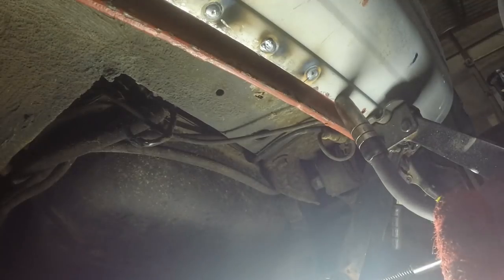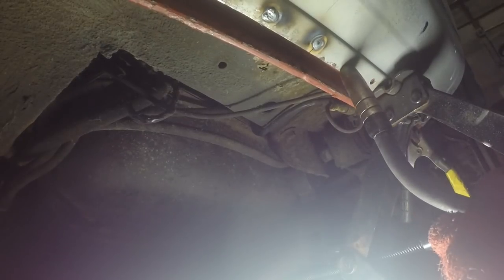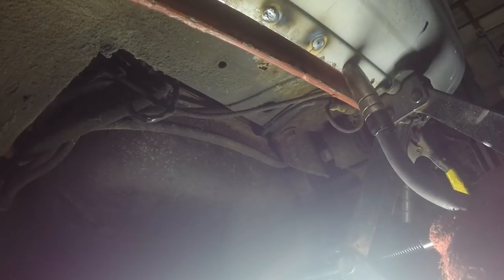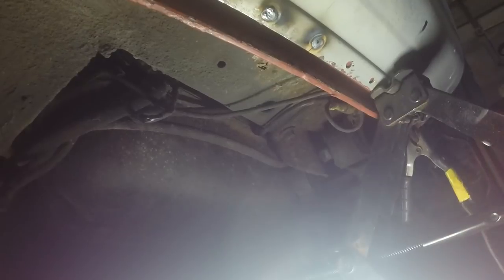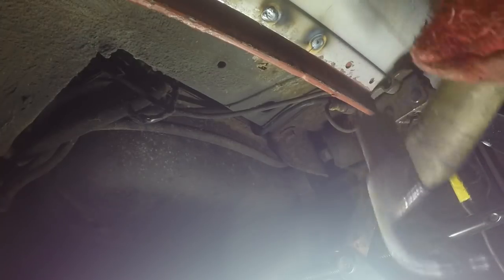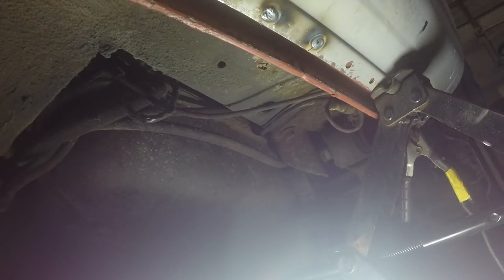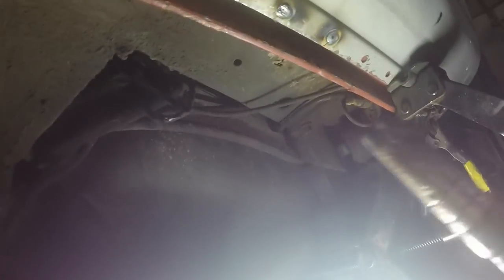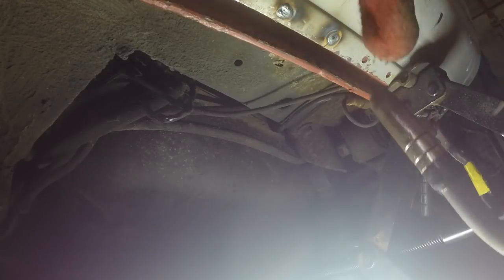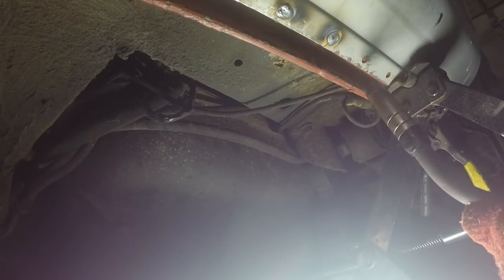You see - when I first struck up the arc the MIG wire bounced off there because it's not actually conductive, but once it's hot enough it does burn through. What happens is it strikes an arc up off the edge, melts the MIG wire which then burns through the paint, which then conducts into that and then you can aim the wire into the reinforcing panel at the back or the thick stuff. I really should be trimming back the gun each time and cleaning it out because all the crap and spatter drops inside and limits the shielding gas, but the MIG's turned up so high that it doesn't really make a lot of difference.